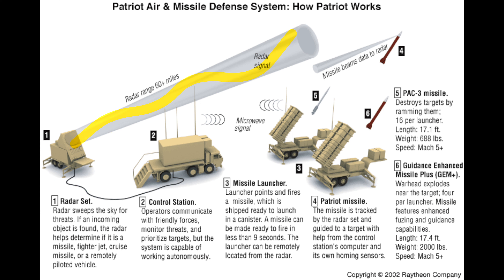An anti-aircraft missile battery is going to be one vehicle, and next to that you are going to have a radar station. What that radar station does is emit radio wave frequencies in the gigahertz range, sending them into the air. As an aircraft passes by, it reflects those waves back into the antenna, and through Doppler and different mathematical computations, you get the location of your target.